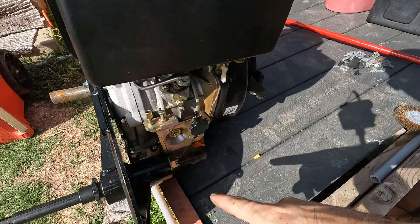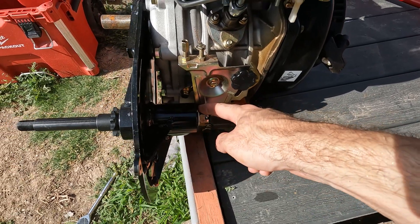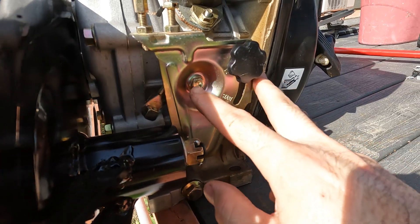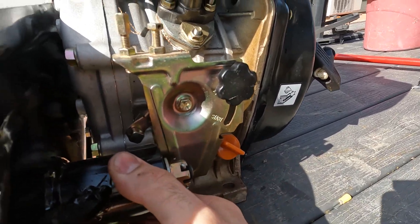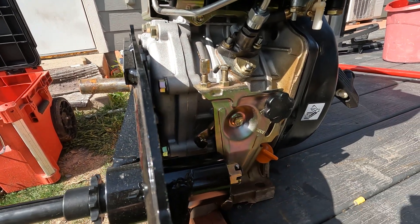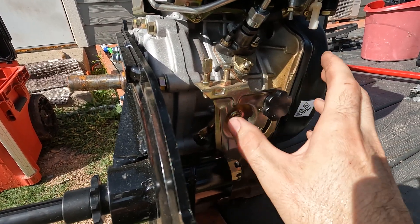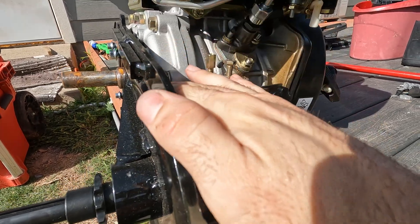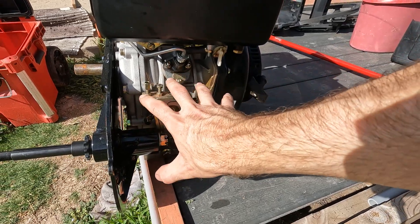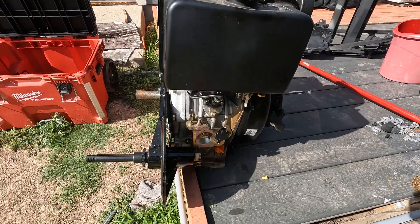I'm already seeing a small problem — the rear end of this is hitting the throttle mechanism. I'm probably going to have to cut this to get it to clear, but let me try loosening it just for now to see if it'll even fit. I went ahead and loosened these two 10mm bolts and the plate slid over enough for the torque converter to sit flat against the block. If you're going to do this be really careful — if you jam the throttle mechanism up the engine will probably run away on itself. I have a plan B to hit the compression lever to kill the engine.